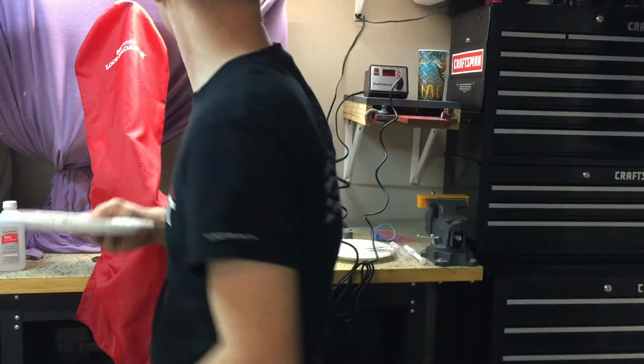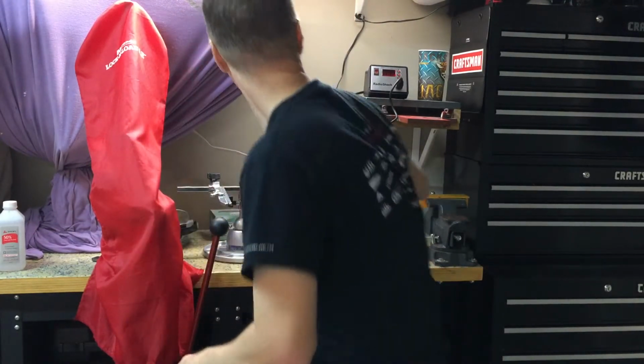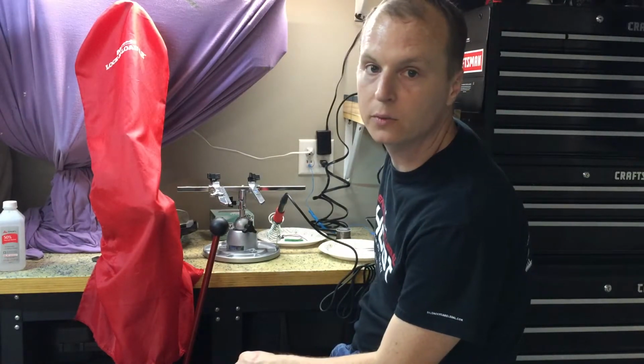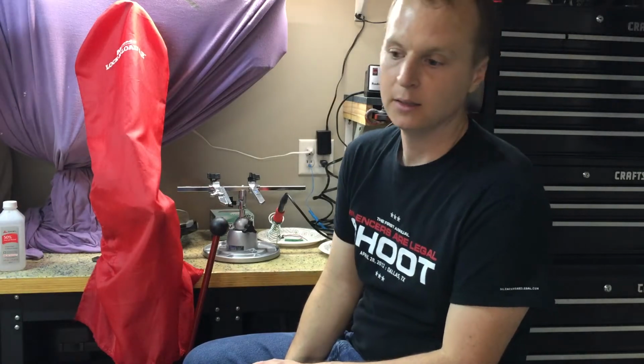Some of the other tools that I've brought out: obviously a decent soldering iron is required. I really like this one. This is probably the minimum I would suggest because it can heat up very quickly and it can maintain its heat, which means when you put it against a decent sized component, it will not cool off, making it more difficult to solder.